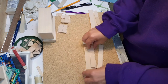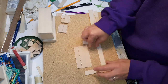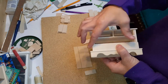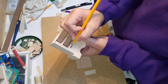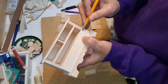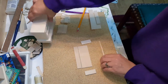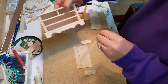For the first step you have your drawer pieces — the two smaller ones are for the sides, one meets the back as the back piece, and the front is obviously the drawer front. To make sure you're getting this accurate, put the front piece here upside down and make sure it's even on both sides. Then mark here and here, and do the same thing on the other side, because that tells you where to put your side pieces when you glue the front on. Otherwise when you put this on the sides may be off-center, and you don't want that.